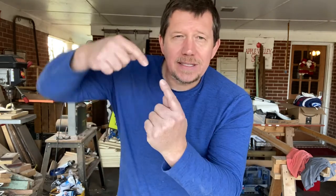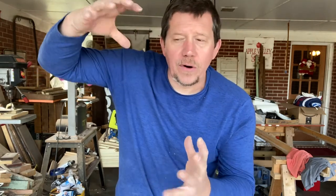What I'm finding out is the more we try to use shiplap in making a sign, it's really not good for that because it needs something to be up against — it's got these little bitty small points of contact at the back and it just doesn't work very well for an independent piece. So we try to make it out of something more stable, and the most logical thing would be plywood. I'm gonna show you how we do it.